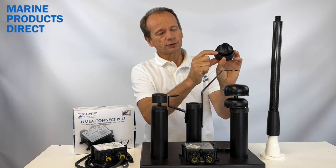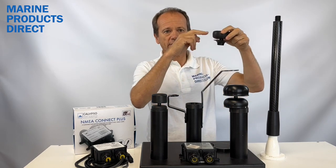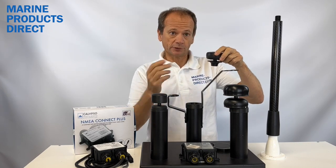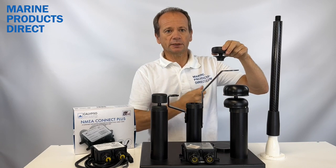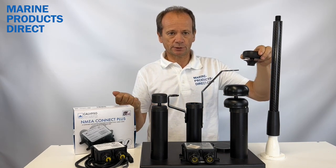The way they work is there are four little transducer plates in there, and they're sending sound waves to and from the base plate. They know exactly the time and direction of flight of those sound waves, so any change in that due to wind flow crossing it is instantly calculated, giving you accurate wind speed and direction data.